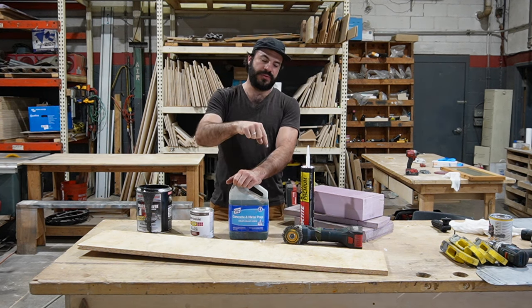it's already below an R value of 5 per inch, which is what this has. So if you're doing your floor, don't use the polyiso. I know it's available and tempting, but stick with the XPS. It really is the best product for that purpose.